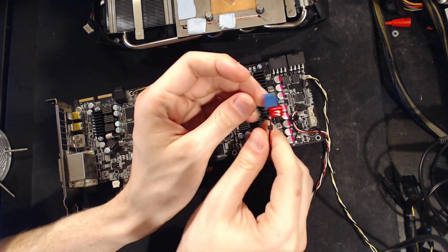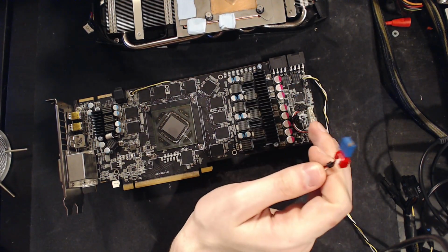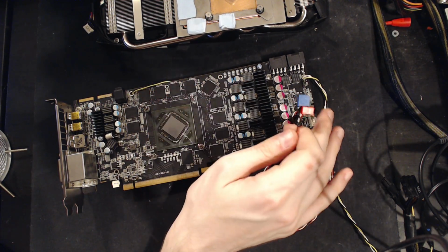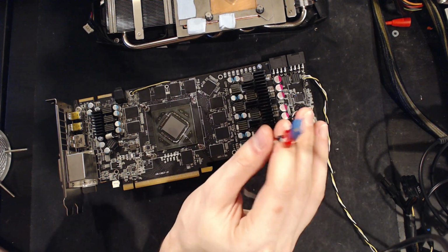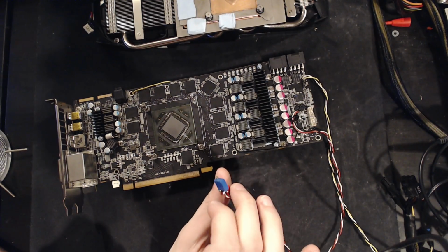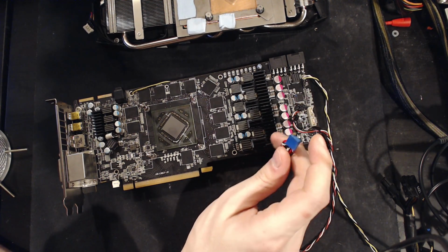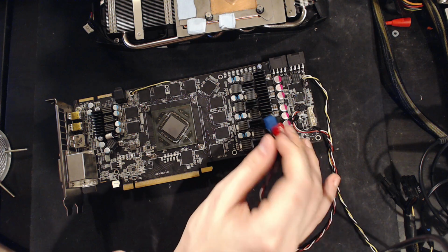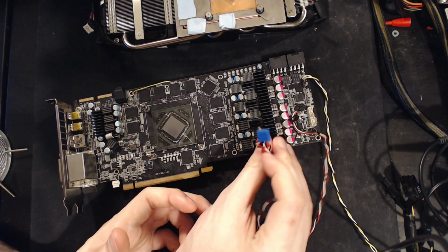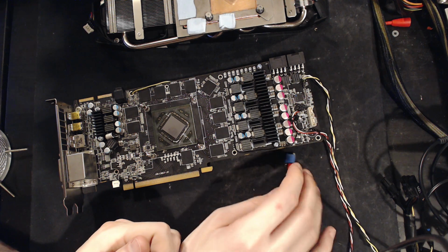the potentiometer, which is a 1k ohm potentiometer. I use 1k ohm potentiometers because you can slap them on literally anything. If something has a 10k ohm resistance to ground, you can put a 1k ohm potentiometer on it, and boom, it works. You can override basically anything with a low resistance potentiometer. Whereas if you have a really high resistance one, you need a circuit that starts with a relatively high resistance to be able to skew it. So that's why I use 1Ks, not 10 or 100Ks.